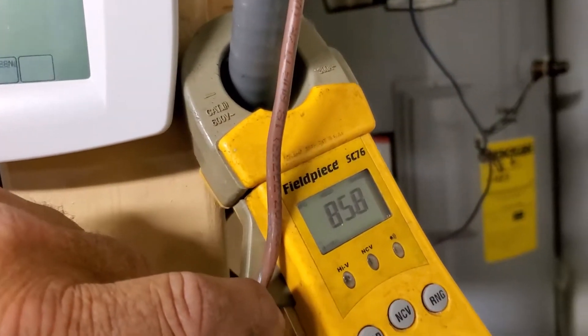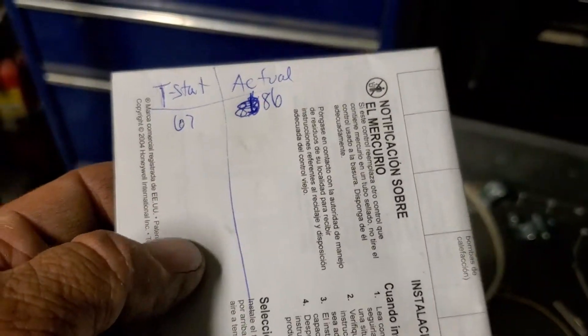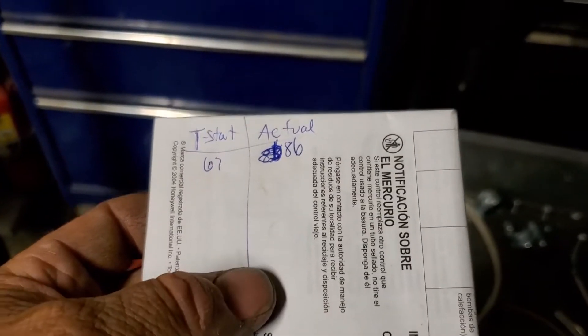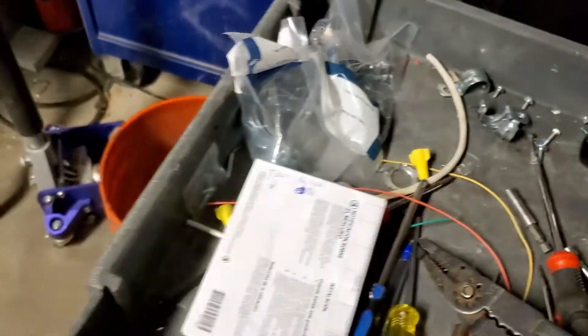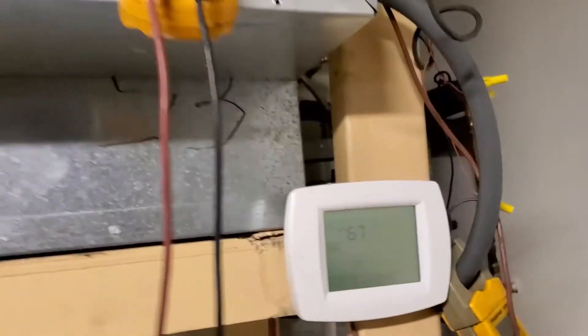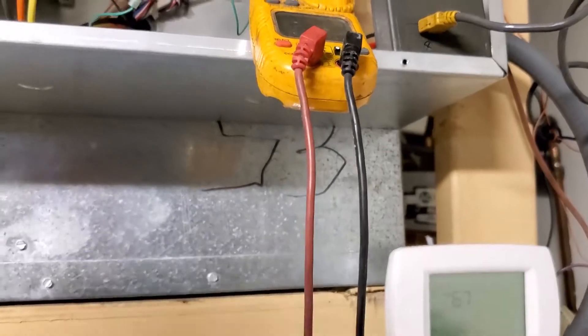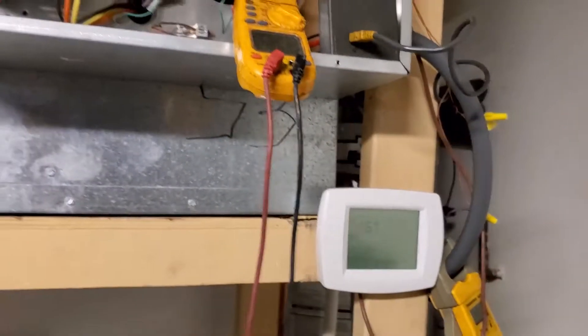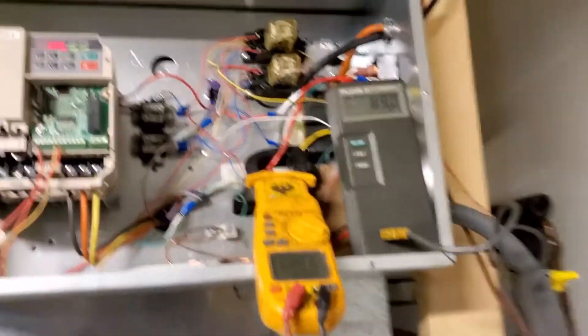It's like 86 in the tank because it hasn't been heated since yesterday. I'm going to plot as it goes up some points, and what I really care about is when it hits 120 — that's really what I need to know, and maybe 110, things like that. Once the microprocessor is in there it won't matter. I'm going to plot the curve through a lookup table or something and actually have it display the real temperature — more fun.